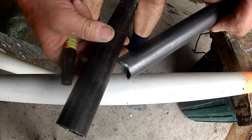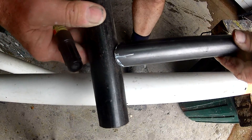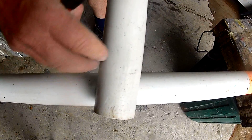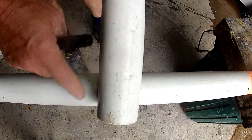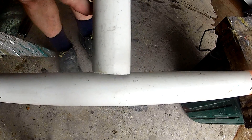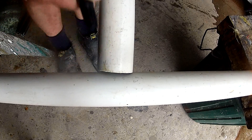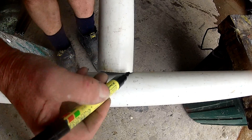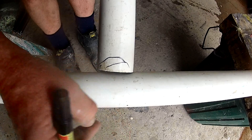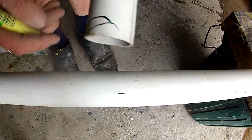One of my subscribers has asked me to show how I mark out tubing before I cut it by hand. This is fairly basic, and for demonstration purposes I'll upscale things so you can see them more clearly, using this PVC tubing. When you're joining two pieces of tubing of the same size, let's start with a 90-degree join because that's the easiest. You're going to cut a semicircular recess equal to the radius of the pipe, which means it's going to go to the middle of the pipe.